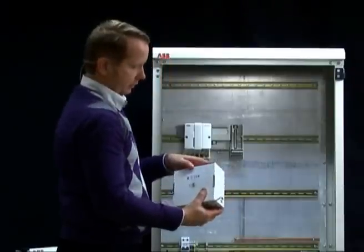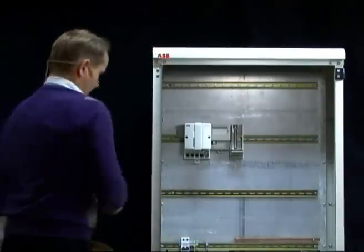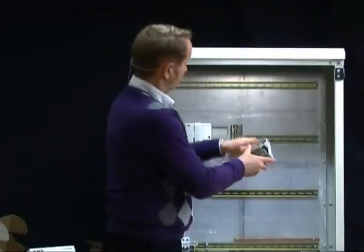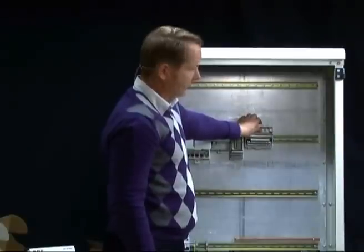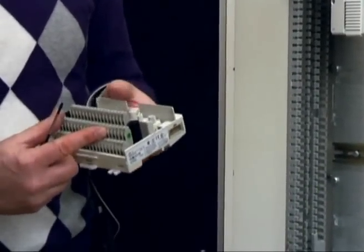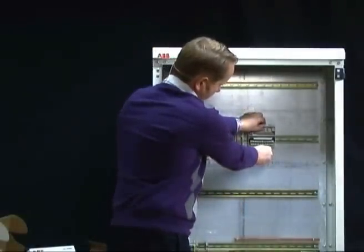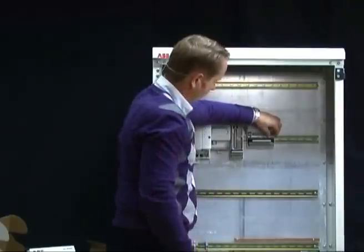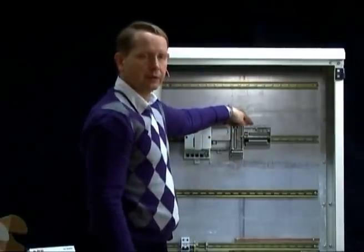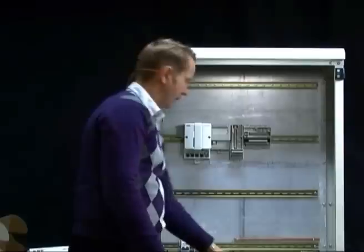The next example is the extended type or family of termination unit. The extended family are made horizontally like this and have more terminals on board, so in these cases you have all the terminals you need. They still fit together mechanically with the same locking device — you mount them on the DIN rail, slide them together, and get the contact you need. So here you can see three different basic types of IO module mounting: the L-module, the compact, and the extended type.